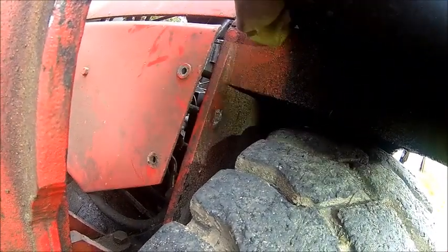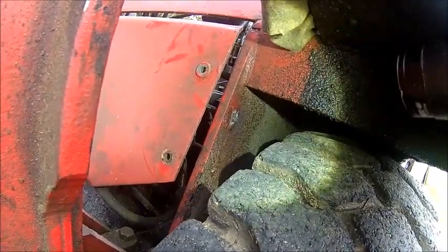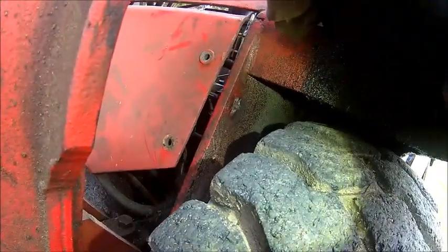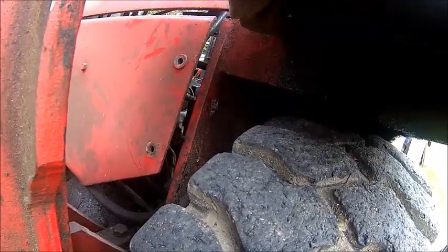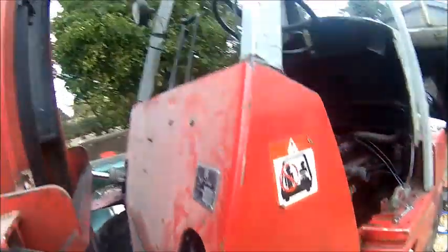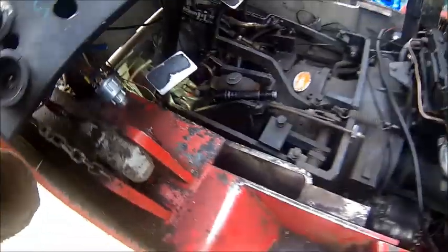We took the plasma cutter and just cut the broken part of the bolt out and ran the tap through. We do the same at the bottom. The thread might not be nice anymore, so I just put a nut on the outside. It's a bit tight, but with a ratchet spanner and a modified tap, it works. So let's do the bottom one, and another one sorted.